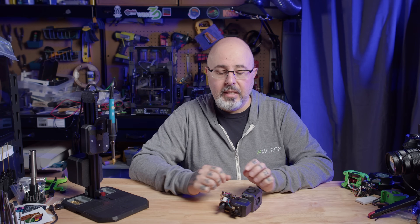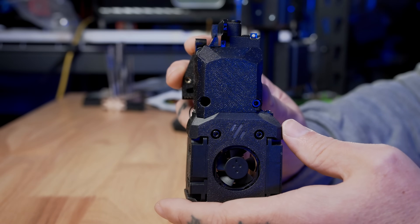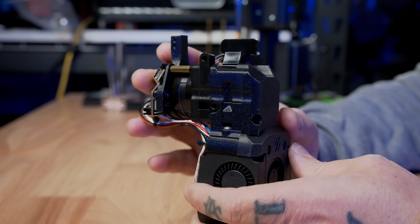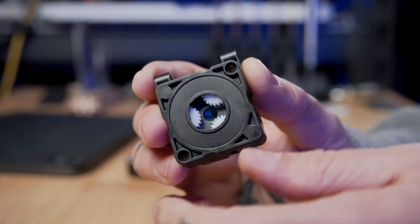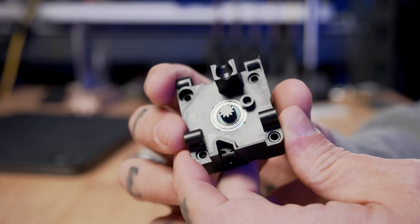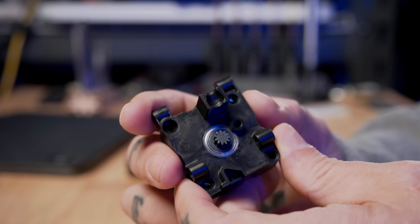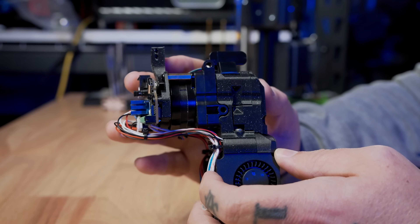The first thing it's going to get is a new extruder — this is the Roto Vitamins Extruder by E3D. It takes the drive from the Roto toolhead, which is a planetary drive like an Orbiter or a Galileo. It's a little different in that it also combines a geared output drive for the filament, where the Galileo and Orbiter have the filament drive directly on the output shaft.